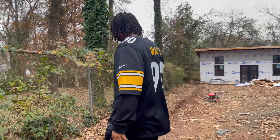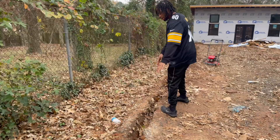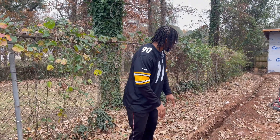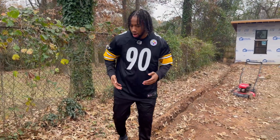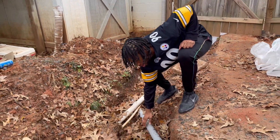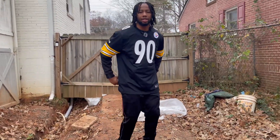Here's where the underground electrical is going. Inspectors want to see it about 18 inches in the ground so it's protected. They also want your wires inside a conduit pipe so it's protected from weather and rain. We were finally able to get that done.